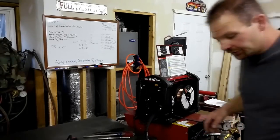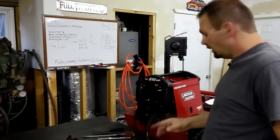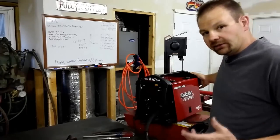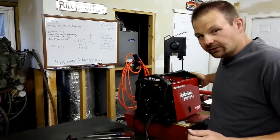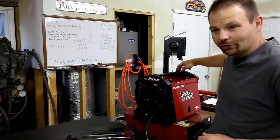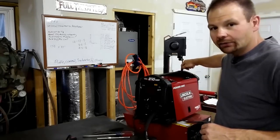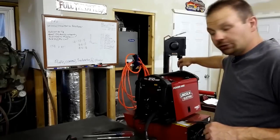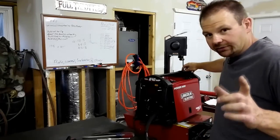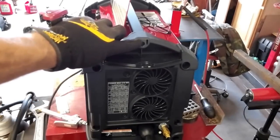One thing about the instructions on taking this apart that I'd like to note is it told me to take this back panel off and then take the cable loose for the fans. Then take this Phillips head screw out up here. I thought it had forgot about this screw, but it was underneath the fan. You can't get to the fan until you take this top screw out. And this top screw you can't see. There's a little panel on the back that I'll try and get you a shot of right here, so you can see that. And there, it's hidden underneath there.